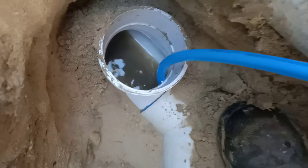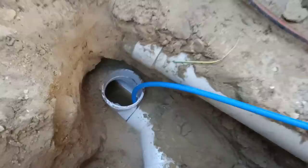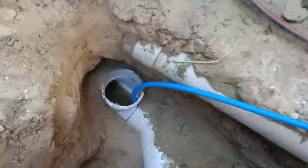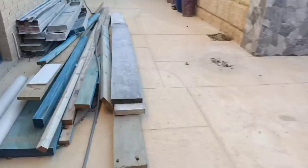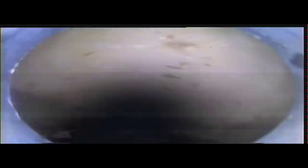I'm sending this right to the head of the line, just to make sure the whole main drain is clear. Give it a really thorough clean guys, because the owners have had nothing but bloody dramas with the drains over the last 48 hours. They called that other plumber out and who knows what he was thinking - we got this sorted pretty quick. We're right at the end of the line now - beautiful. Just double checking this line - there's a junction here that I think goes to their upstairs bathroom. It's looking good - we've sent the jet right to the head of the line so it should be absolutely perfect. We'll pack this up - thanks for watching.